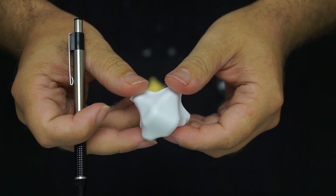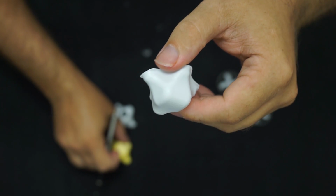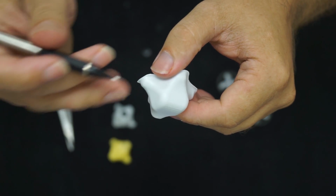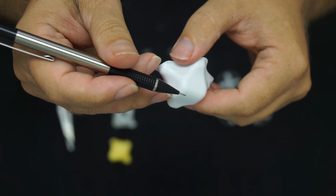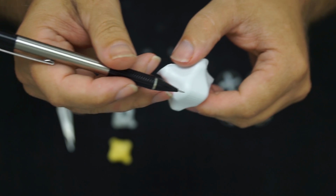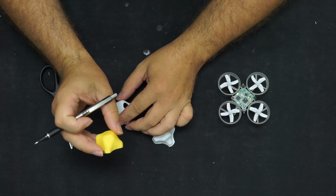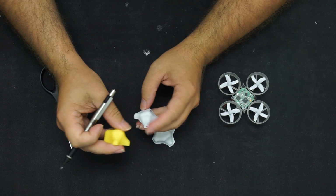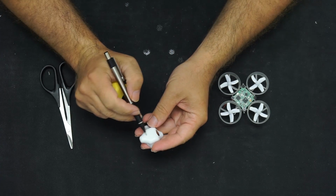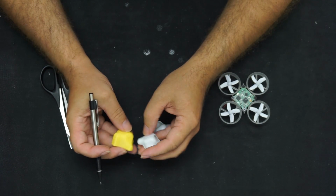So as it vacuum formed, you can actually see in this, as I rotated it around, this was a fairly crude 3D print, 0.3 instead of 0.1 for a fine one, and you can actually see the little individual lines. You can see the resolution and how thin this plastic actually gets. So you could 3D print a really high-res model for a mold so you don't pick up these little lines, even though it's not even that noticeable on this. I'm pointing them out so you can see it.